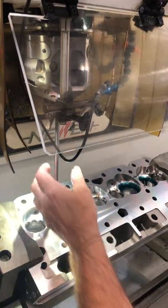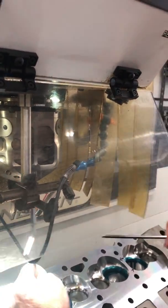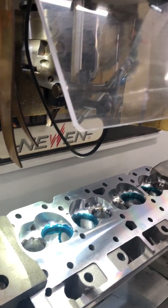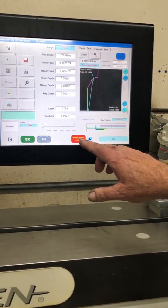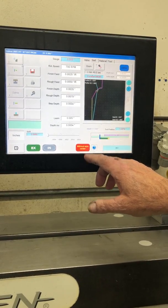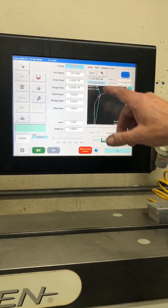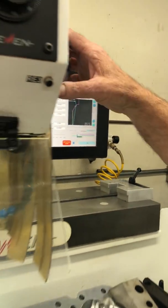Bring this up, remove the pilot. One important thing — when you do the machine with a Newen machine, you do not use Auto Center. We have the red light on; it says 'without Auto Center.' As you can see, we've got the program there. It's a real simple program — a minute and 43 second program that will be running.